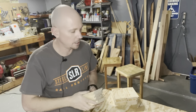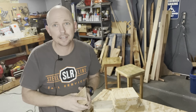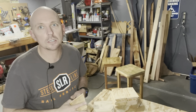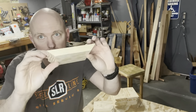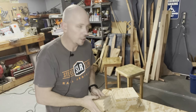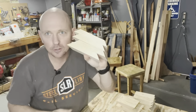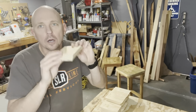These on the outside measure five and a half. I don't have official plans — I don't use SketchUp yet, I hand draw everything, so I'll put dimensions in the description to best help you. This is just a one by four; I use the more premium pine that's already cut and sanded, which comes out better with less sanding at the end. One eight-foot board will give you four sets with one piece left over.